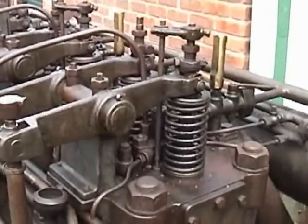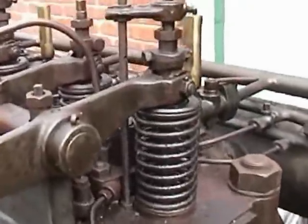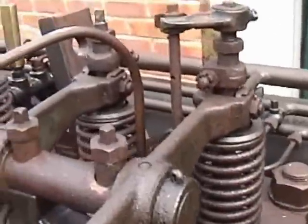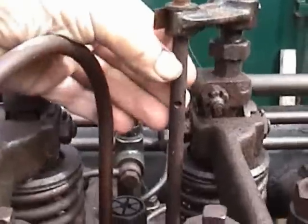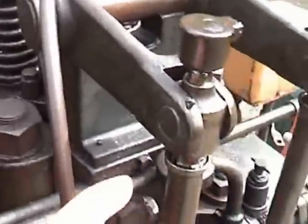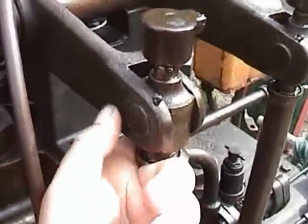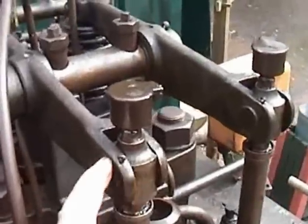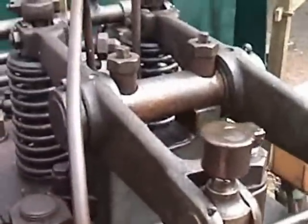Because we don't know when the engine was last barred around, and we don't know if any of the valves might be sticking due to rust — as you can see, this slides up and down and is extremely rusty. So what we're going to do is remove the pins from the pushrod to the rockers, so we can bar it around without operating any valve gear.